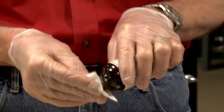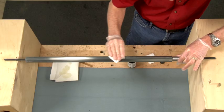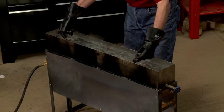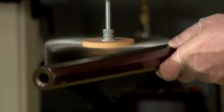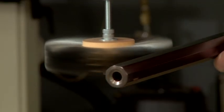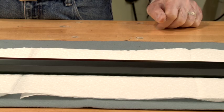The pads should be damp with solution, which is applied in long even strokes. Over a few hours the metal will develop a velvet layer of red rust. Boiling the part in water turns the red rust into black oxide. Then we card the surface using a fine wire wheel at low speed. This removes the velvet layer leaving a smooth darkened surface.